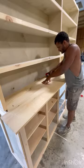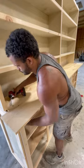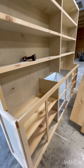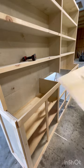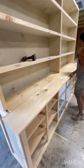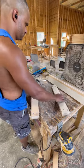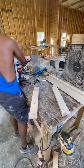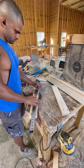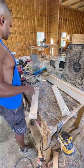Moving into the top shelf portion — this is the same one-by-ten pine I use for the trim. I made the first piece that goes all the way across at ten foot, then measured the inside from shelving to shelving, which I think ended up being about 113 inches. I glued those two together, sanded everything down, stained it twice with Special Walnut by Minwax, and then two coats of polyurethane also by Minwax. The whole bookshelf got stained Special Walnut.